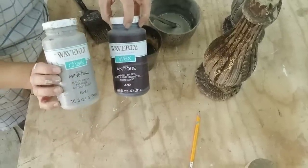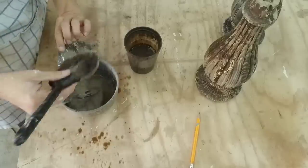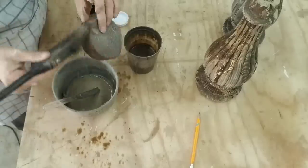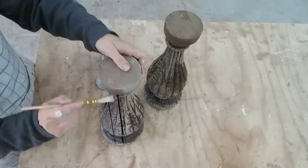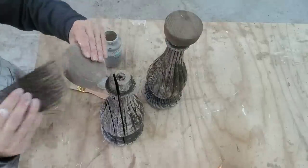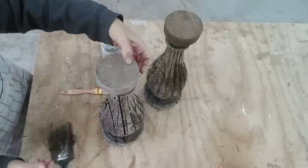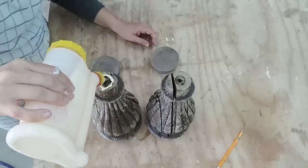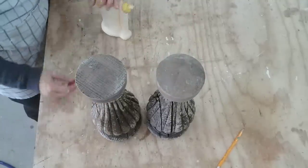Next I'm going to take a mix of gray chalk paint and antiquing wax to try to get the top pieces to look aged like the rest of the piece. You can turn any paint into a wash if you just water it down. There's a lot of gray and brown in this piece, so I'm just mixing it up. Once it was dry I felt like it needed more gray, so I'm dry-brushing with gray chalk paint, then coming back with a wet brush to smooth it out — a little trial and error, just trying to blend into the original piece as much as possible. Then I apply wood glue on top, set the wood piece on it, let it dry a few minutes, then come back with my nail gun and nail it into place.